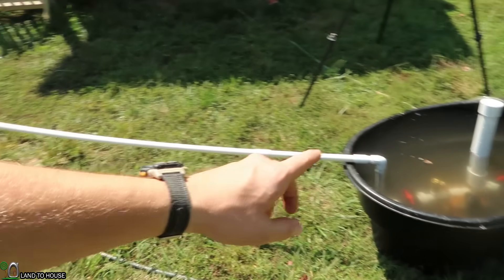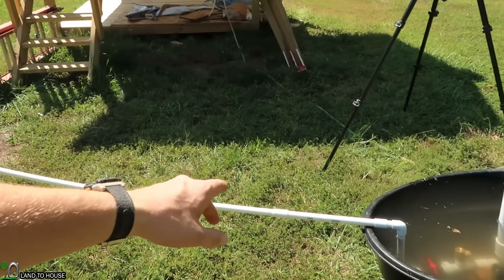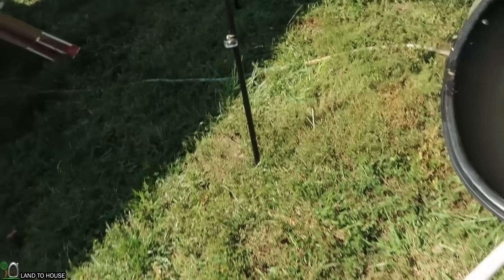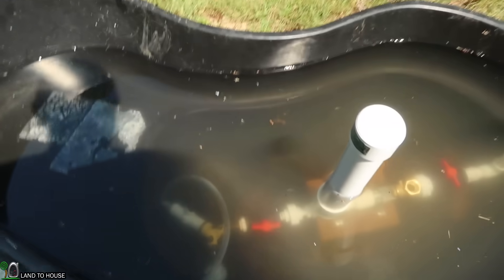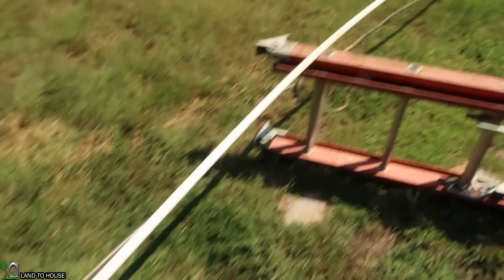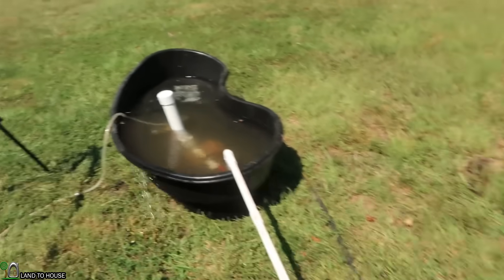Having the pump underwater can also reduce the sound that the check valve makes whenever it clicks. You could still hear the pressure wave going back and forth in the drive pipe, but the valve itself didn't have that iconic click. Let me close the delivery totally — which means it's going to hit a little bit hard — but we can still get a decent sound here. That's not the sound of the valve; that's the sound of the drive pipe popping against the side of this little pond. You can still hear the noise that the drive pipe makes as it cycles.